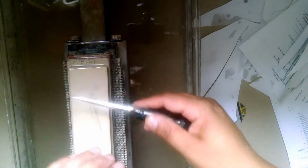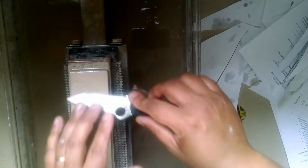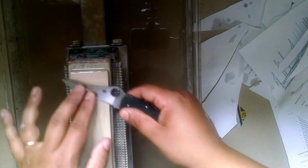Murray Carter calls this scary sharp because he's not polishing off all the teeth. He's just refining them on the 6K stone. I mean, you could also polish the knife up to a nice mirror finish using the 6K stone. You just have to be careful that you don't crush your edge around the apex, over-polish it. You'll lose that nice bite. It'll definitely give you a comfortable shave, but it's just not gonna cut very well. You'll just go dull faster.